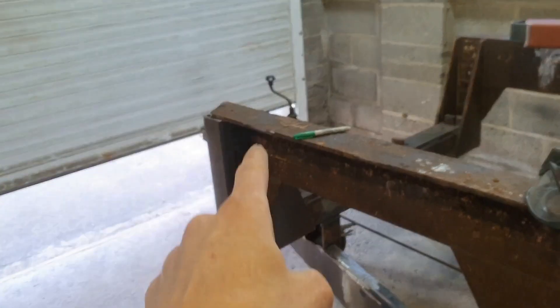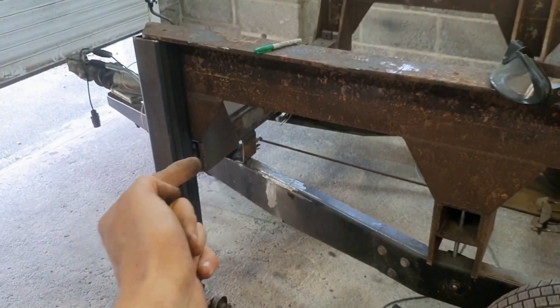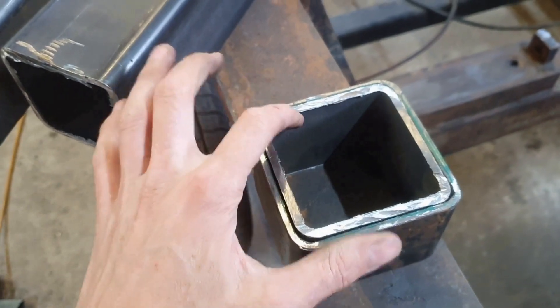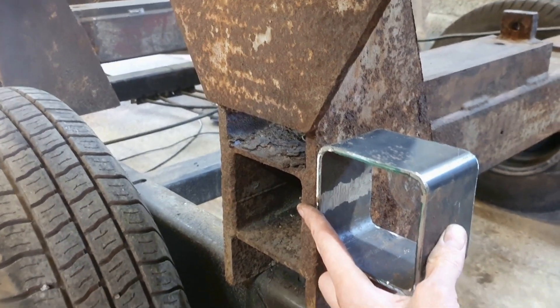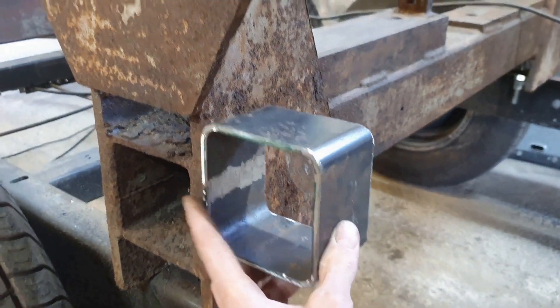Now I have a template, I can make all the legs to match that one perfectly. While the frame has somewhere for that little section of box to go at the front, it does not at the back because the mudguard will be there and it will foul the wheels as well. Which is why I'm going to weld this piece — which fits over the top of that piece down there — onto here, to create the same effect as at the front of the rolling road trailer but for the rear legs. So now I can offer that leg up, jack it up against that shelf and tack weld it in place.